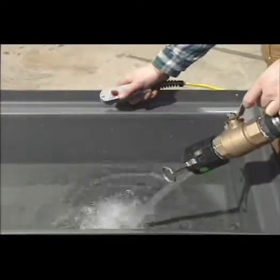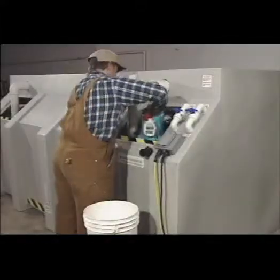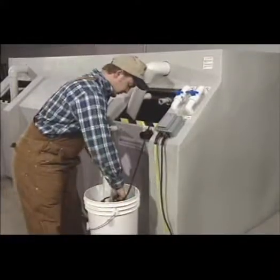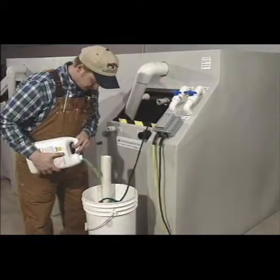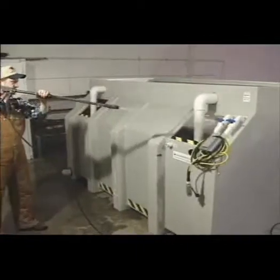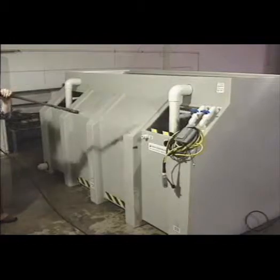Flushing the pump can be accomplished by filling the cleaned main tank with fresh water and pumping it out into a catch basin or vessel. Another method is to place the pump into a five-gallon pail of antifreeze for the off-season. Keep the pump submerged until the system is placed back into service. Be sure to hose off any remaining salt residue from the piping, valves, and all exposed surfaces.